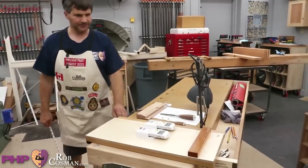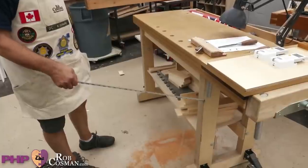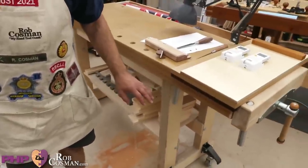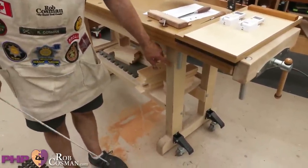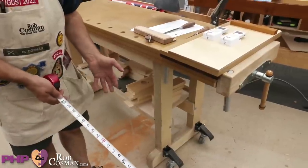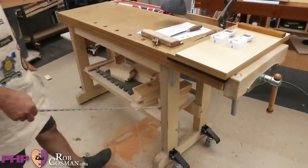It's heavy, it's solid, and it stays nice and flat. The base is made up of 4 pieces of 5/8 inch Baltic birch. And the nice thing about Baltic birch is they don't use a cheap, inexpensive core. So it's birch wood cut very thin into what we would call veneer, and just like the way plywood is made, but each piece is the same thickness. Well, when you glue them all together, and the way we do it, you build it almost like Lego. It's being glued and stapled together while you're building it. So when you're done, you don't have to have 100 clamps. It's all done. And when it's set up, it's like you're dealing with a 2 1/4 inch thick piece of plywood.